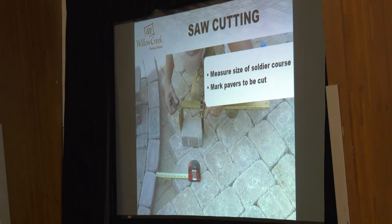Make sure your pattern is coming out square from the house. It doesn't matter how many times you try to explain to a homeowner that their house foundation is crooked — if your paver pattern looks crooked, you're just making excuses. There are a lot of different ways to make these cuts. One other thing when going around a circle: I'll pop that center paver out, put my spike and string line back in the center, and take it around to mark outside the circle. I'll overlay the pattern so I can just take my pencil and run around to mark all the square pavers — because we're going to have to cut every square paver that makes contact with our circle.